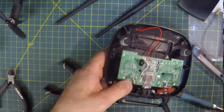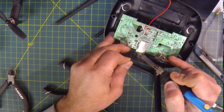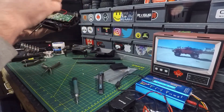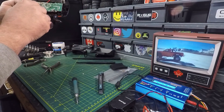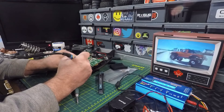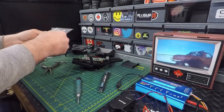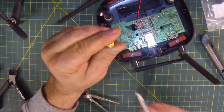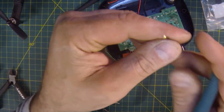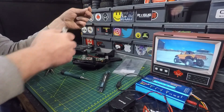Our positive is on the center. We're going to see if we can get some heat on it and get that out of there. I just took that outer one out — just want to verify that it is indeed my negative. Yeah, it is. Our positive of the antenna is our center here. In this antenna your positive is your pin and your negative is the outer part. Keeping this as long as possible, we're going to just clip off the little end here — get rid of that, we don't need it. We need to strip the outer black sheathing.